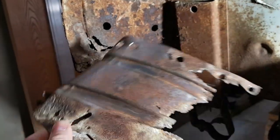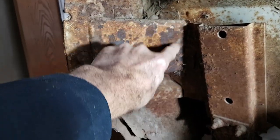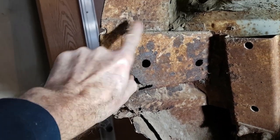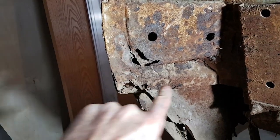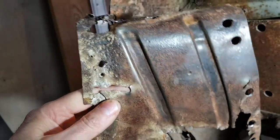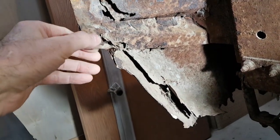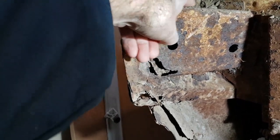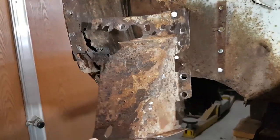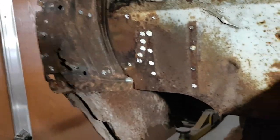So let's get on this piece and get it built. I thought what I would do, because I have a duplicate over here — a mirror image of it — I would pull this bracket off here. It has to come off anyhow, so I'll take it off now and tuck it away. Then I can get some good measurements off this piece that's the mirror of this. Shouldn't be too big of a job — a few spot welds here and there and I'll have her off in no time. Got this piece off right here. A lot of good information in this piece — more than the other side — so I have lots to work with there.